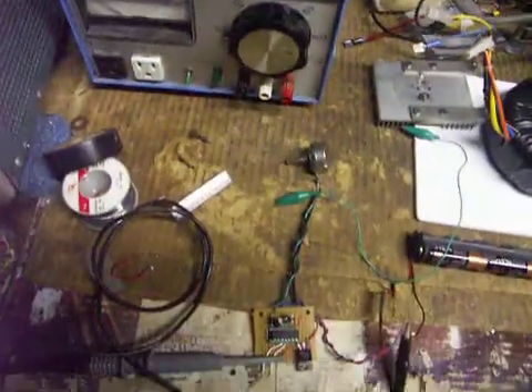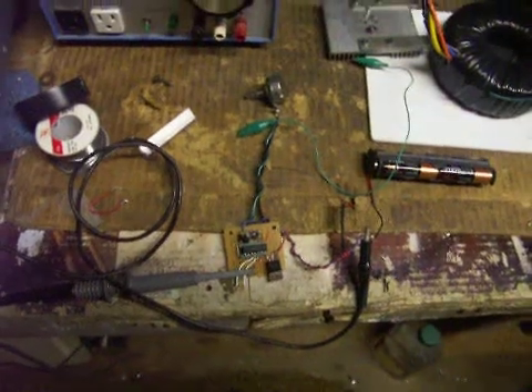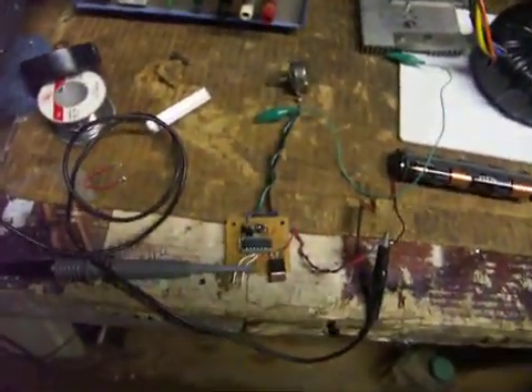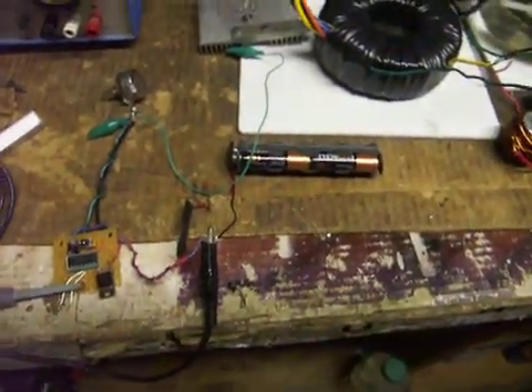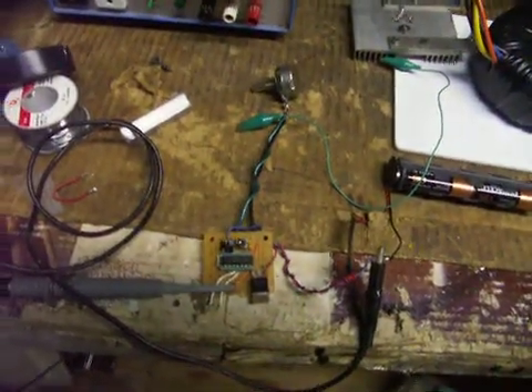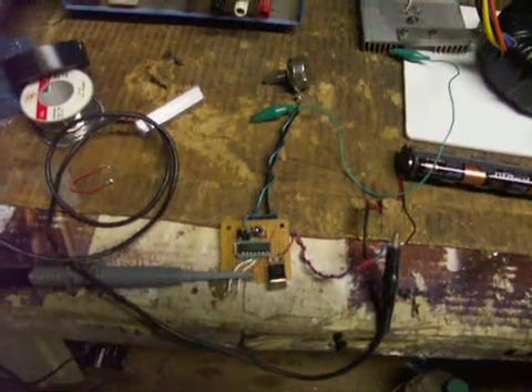Since I can't pull a lot of current off this little chip, the Darlington pair works wonderfully. I have the chip here running, hooked up to my oscilloscope. I've got it connected to a 6V battery pack, just as a test setup. The frequency is 50% duty cycle fixed.